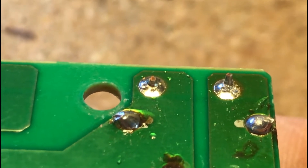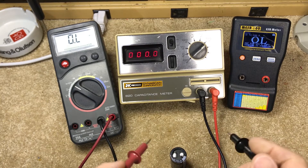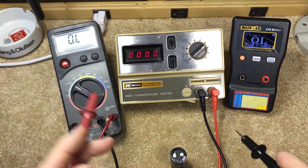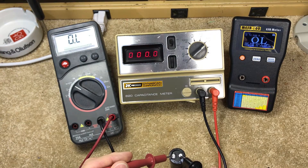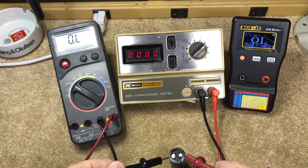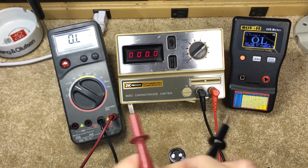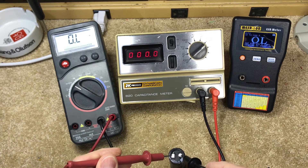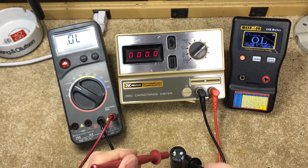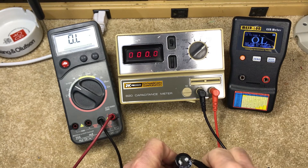I'm going to clean this up and solder it properly. Since we're going to be testing capacitors, let's talk about the ways to do that. The most common way for many years is to use a multimeter: put the leads on the cap, you'll see it charge up through the display and then make it back to infinity. Switch the leads on the cap, do the same thing — it goes up then back to infinity. That's a good cap. The next way, more accurately, is to use a capacitance meter.